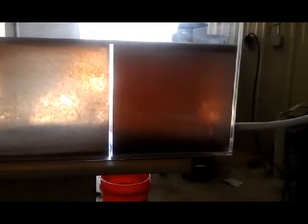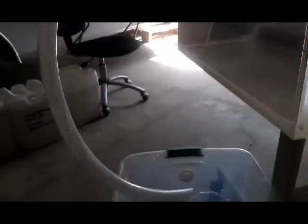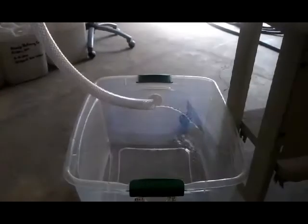How do you clean the floc from the water after it's been treated? The water flows into the first weir and is held back. The floc is trapped going into the second weir. Only the heavy material can move through into the third weir, and by the time you get to the fourth weir, you've got pretty much clean water coming out the end and out the bottom — fresh, clean water.